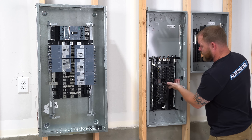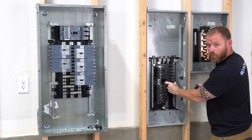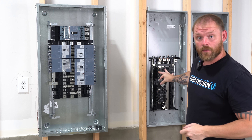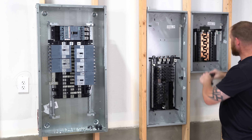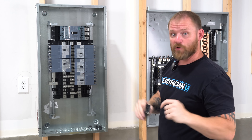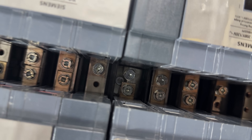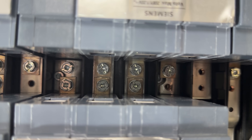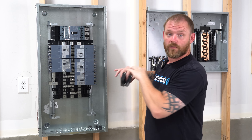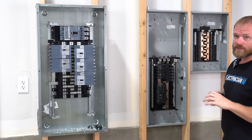There are also differences in breakers — some breakers just stab in: you hook them and stab them, with no bolting required. And then there are bolt-in breakers. Some load centers are bolt-on style, meaning they have little holes where you have to secure and bolt the breaker in so you can't just pull it out. That's pretty common in commercial load centers. This panel board has that too — every single pole on here is bolted in place, so there's no way this thing is going to come loose and arc. But that's not unique to just commercial panel boards; a lot of load centers have it too.